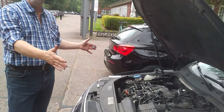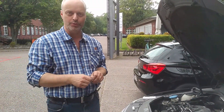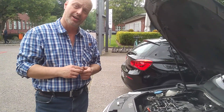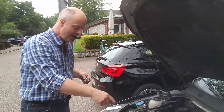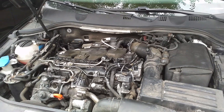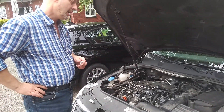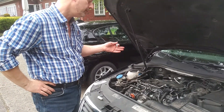If you've reached this video, you're probably owning one of these Volkswagen TDI turbo diesel cars — in this case a 2010 Passat with a 170 horsepower 2-liter engine. At around 200,000 kilometers your engine will start having problems and report a P2015 error. This problem comes basically from an actuator that controls the throttle valves in the inlet manifold. Over time it wears out, and when it goes back to basic position it goes too far, making the actuator unable to move the throttles anymore.